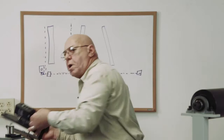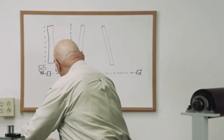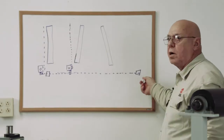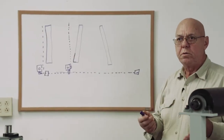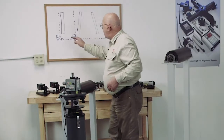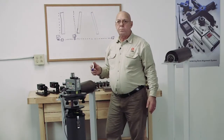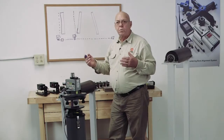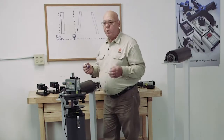When we get that bucked in and the laser is level, we have these targets mounted on floor monuments. We mount the targets on these, and we place one target down here and another target further down, and we make those targets read zero. So now these two targets are set up perpendicular to that roll, and these now become our reference. When we were setting up, the roll was our reference; we set up the targets to become our reference.